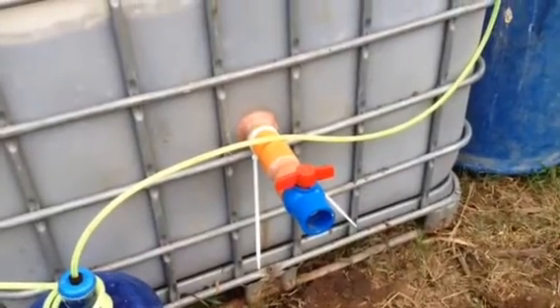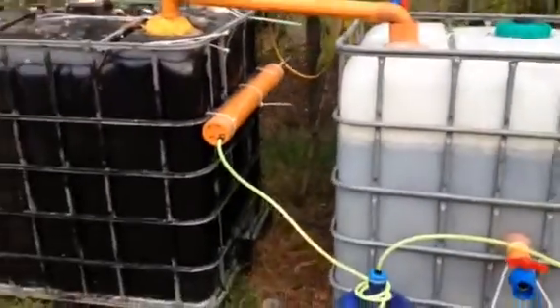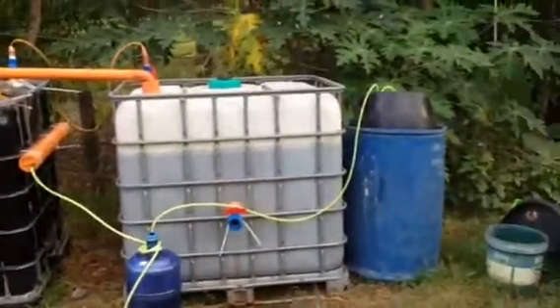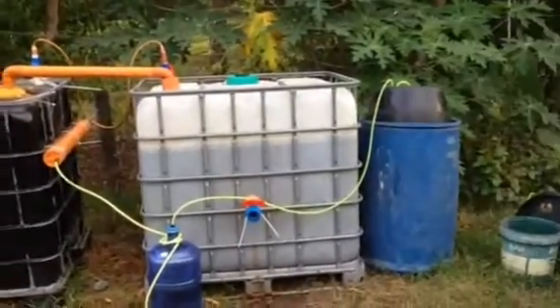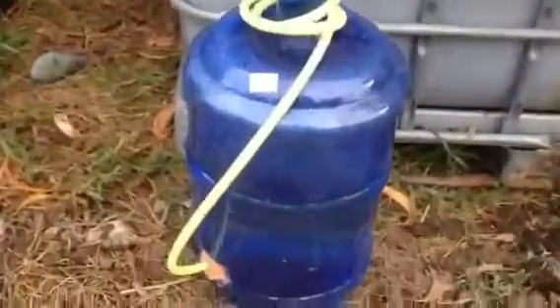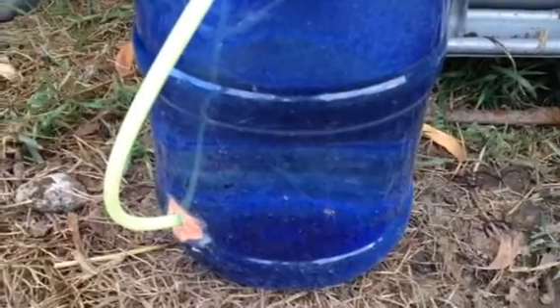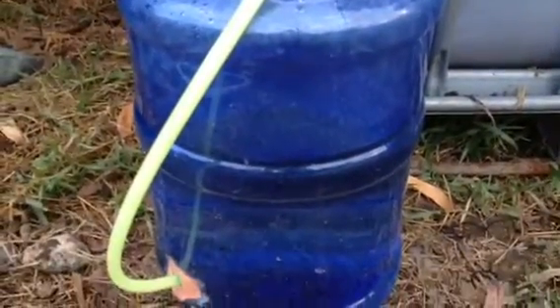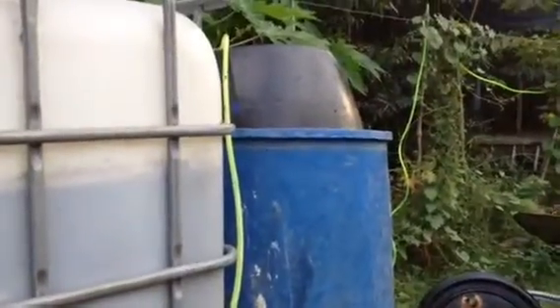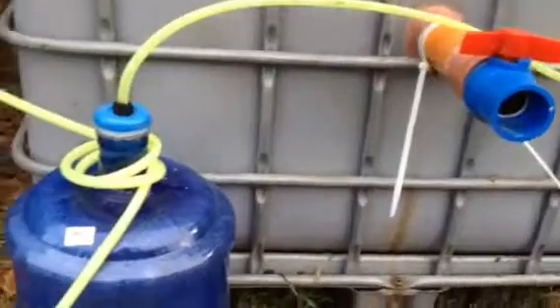It's an organic fertilizer, really good — richer than undigested material. Here's a bigger picture of how it looks. As you can see, the bubbler is still creating methane, which is great. Usually a biodigester is really efficient when it's hot. It's a bit cooler right now so it's kind of slow, but as long as it's creating methane we're good to go. I'll show you how the lamp works later — it's still too bright out right now.